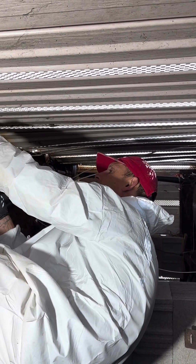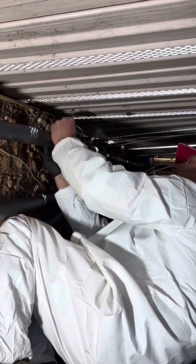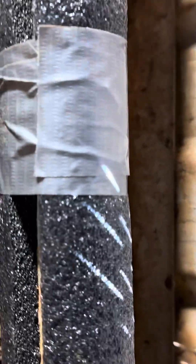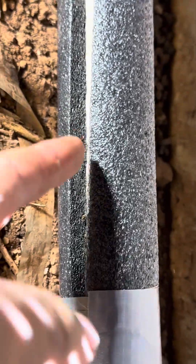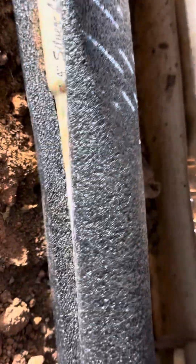You never want to put the slit facing down. Even though it's taped and I'm pulling it tight — Kevin, show them the side — you're still going to have a gap. You never want the gap to face the ground because cold air rises up from the ground. It also looks better when somebody looks in and doesn't see a crack. I hide it so it looks nice and neat underneath the trailer.